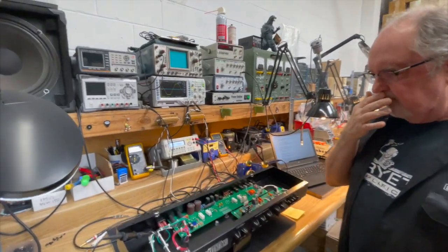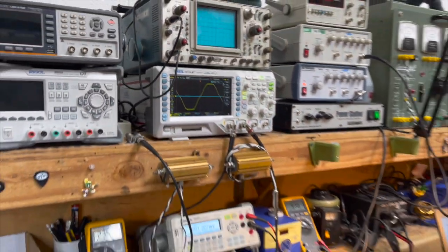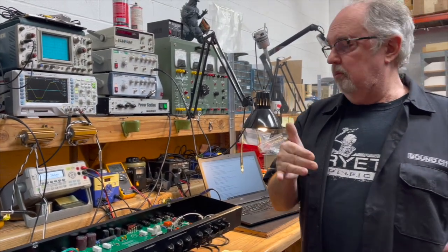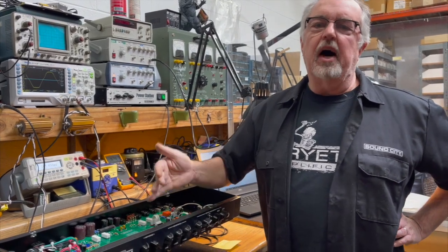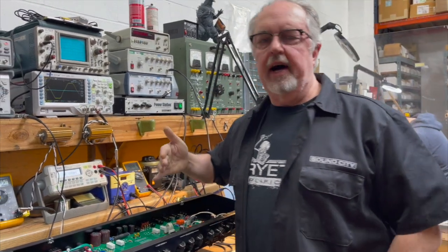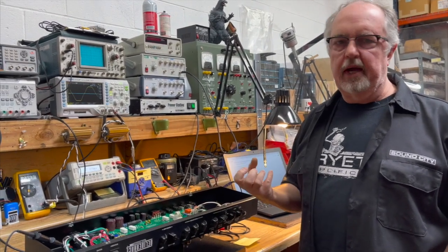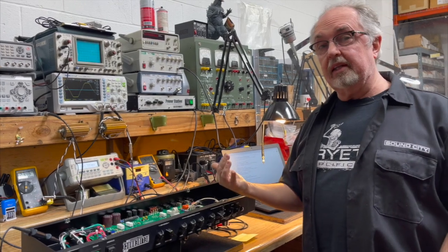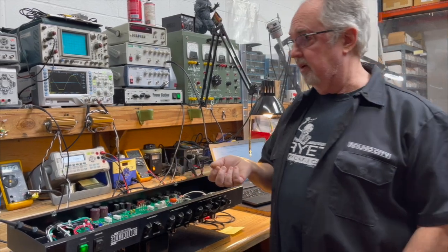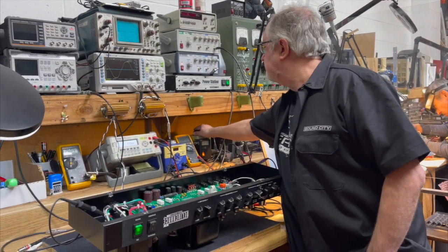The time we had Friedman's 50 watt Marshall in here and we were showing how that operated cranked down with the variac, we also recall that we had the amp biased for full idle current at the 90 volt setting. The tube would overheat if you ran it at 120 volts at that bias setting. But he's not running it that way, so he's always keeping the variac on there. For this, the correct bias setting is how it would behave at 118 volts, which is up here.